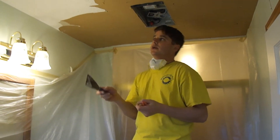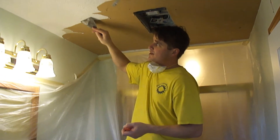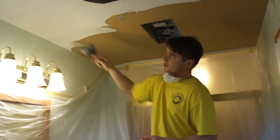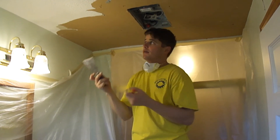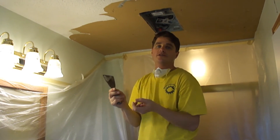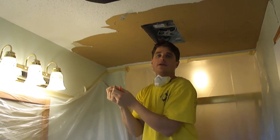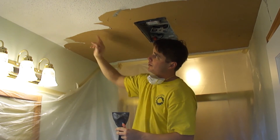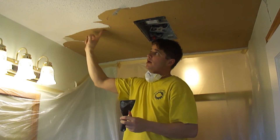What I'm going to be doing here is dry scraping. You can either dry scrape it down so that it's flat, or — the method I'm doing — I'm going to treat this like it's wallpaper. I'm going to gouge it in, try to get it loose, and then peel it off. What it's going to do is peel off the top layer of the sheetrock so that you get down to this brown paper.